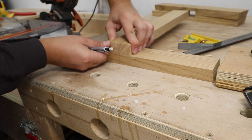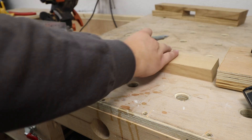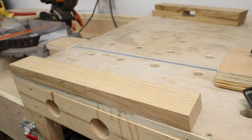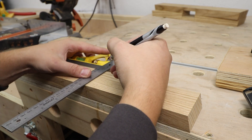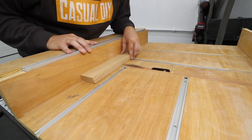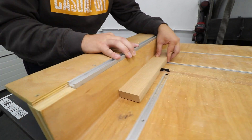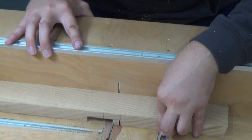The top and bottom supports of the legs will be jointed in the middle with half laps, so it's very important to mark exactly where you're going to cut the half laps on those four pieces. I'm making sure I'm at the right middle of the boards and marking the correct thickness. I'm using a table saw with a sled to remove the material from the middle of each board, but you could also use a router or even a chisel — for me this was the quickest way.